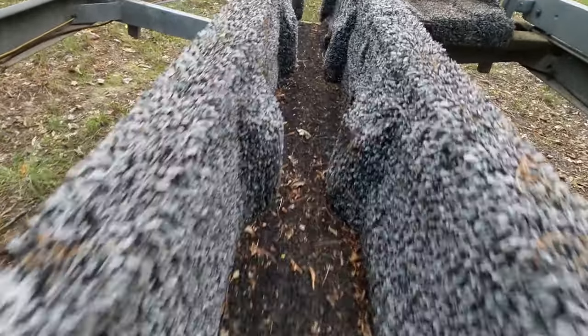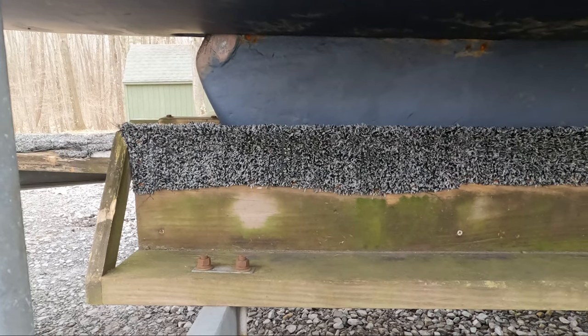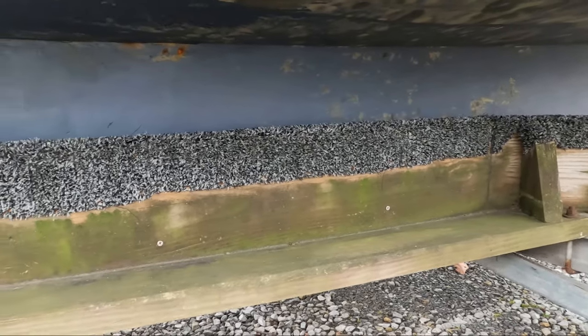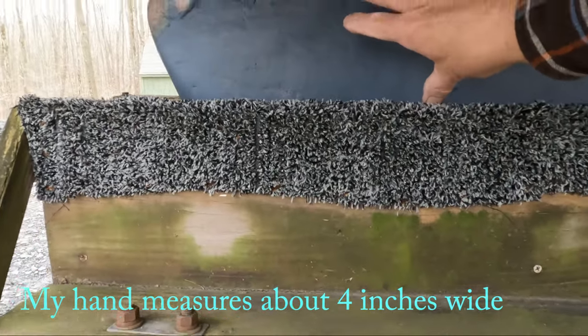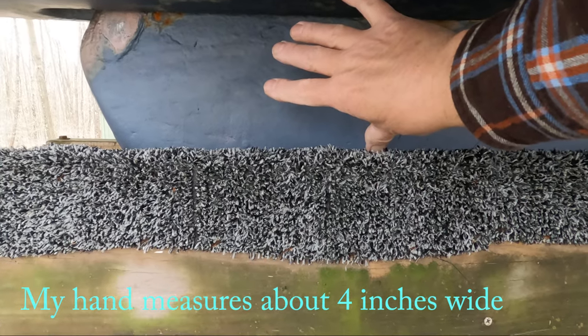When the keel comes in contact with a guide, the hull is very far forward on the trailer, so the guide does not have to be very long, but high up next to the hull. At this point, the bow is coming up very close to the winch, so the hull has to become centered on the trailer because there are no other options.